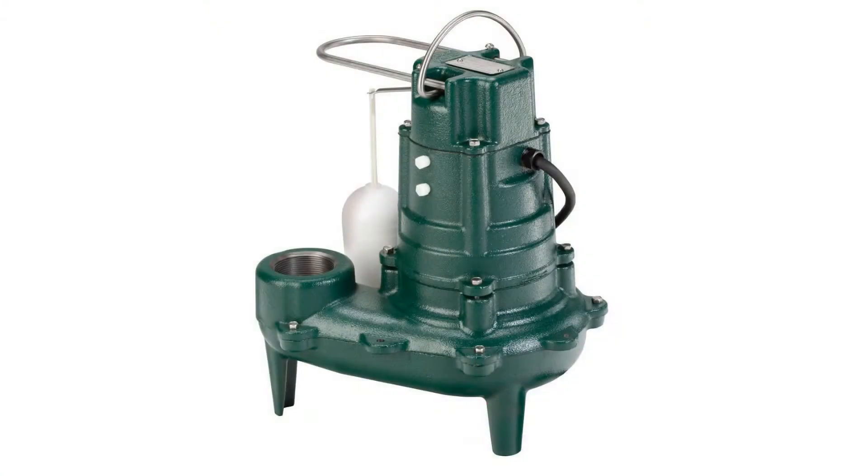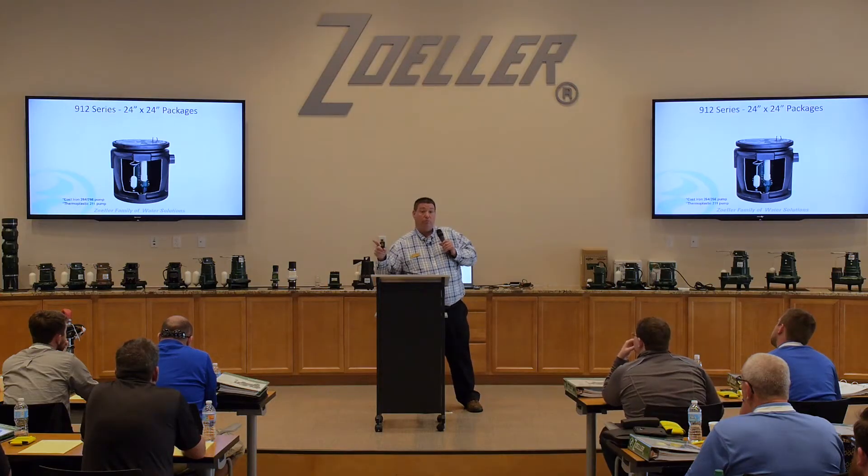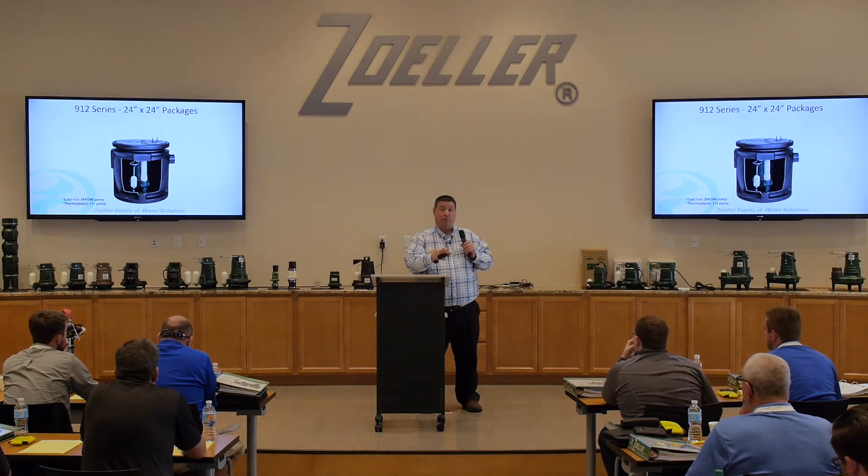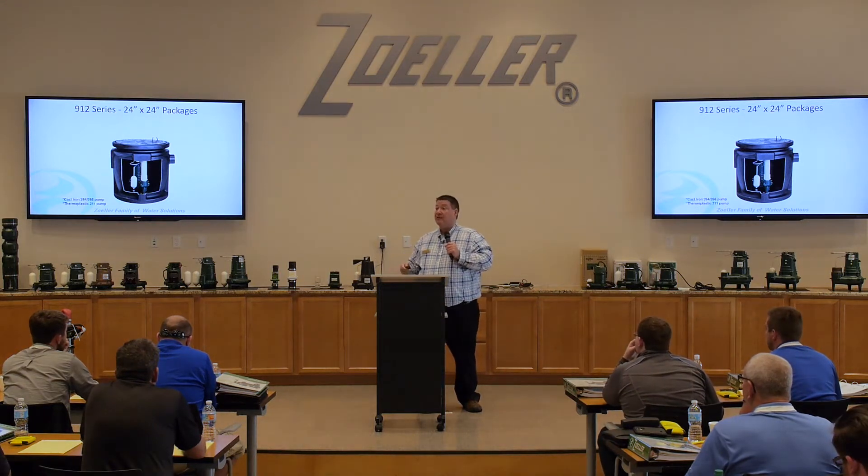If you run into a gravity sewer system, you would generally use a sewage ejector. All that's doing is taking that sewage — in some cases this might be located in your basement. In my territory we don't have basements, so some of these systems are located outdoors. The pump pumps basically to the road, and from there it flows downhill. That's where you'll see the sewage ejector type pumps.